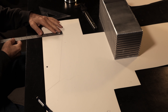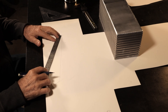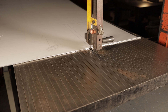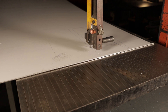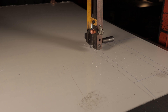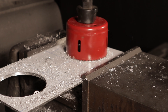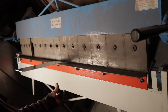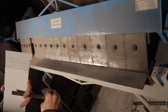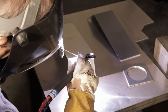A good place to start is the two side panels. After drawing the side view of a panel, a measurement was taken of the total piece in length. Then a template was made of the side panel laid out flat. The pattern was transferred over to aluminum and cut. The aluminum sheet I used was 125 thousandths thick and the material grade was 5052 — I use it because it's shiny and pretty. Up next is drilling the 3-inch holes for the air inlet and outlet. Then bending the side plate angles taken from the specifications on the drawing.